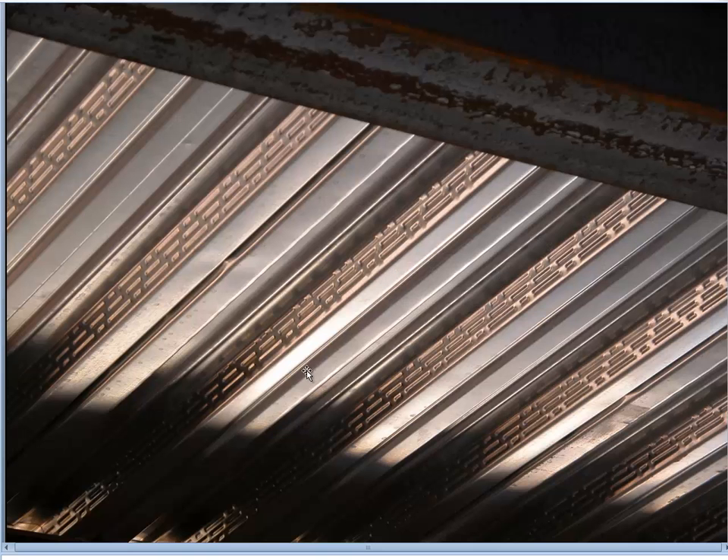This is a view from below the decking — this decking has been sort of crimped or damaged here, but in essence we've got the bottom flute and up in this groove we've got the top flute, and this embossing is occurring on all the nearly vertical sides to assure this composite action.